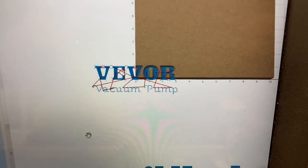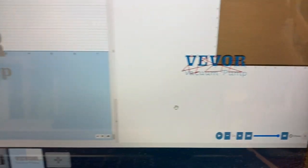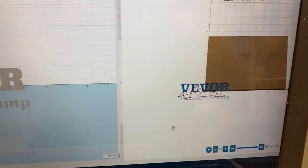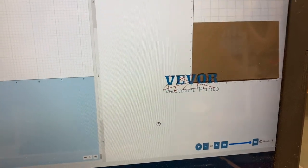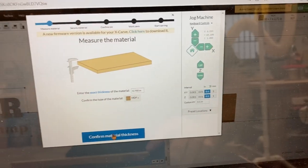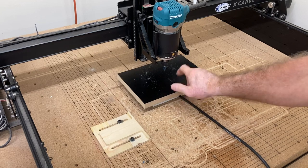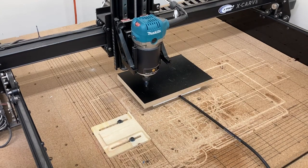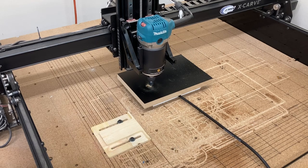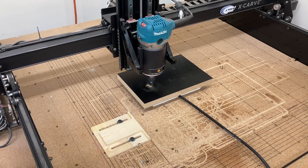It does show that it's not on the board, but it's in the work area, and that will carve just fine. I know this is confusing to a lot of people, but I hope that you can see exactly what's happening in this simulation and what's actually on the CNC machine itself. It matches exactly. All that's left to do is just go step by step through this checklist. I'm going to run this without the dust boot so that you can actually see what's going on. And now for the true test to see if this vacuum pad is going to hold with this vacuum pump. It's anybody's guess at this point to see if it's going to be strong enough. So far, it's looking pretty good.